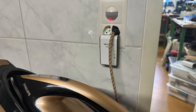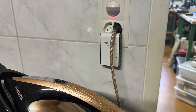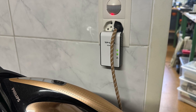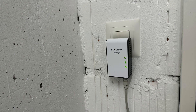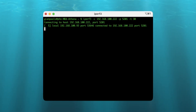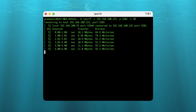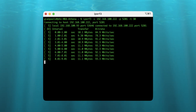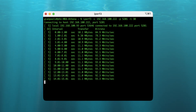To compare, here's another wall plug which I know is on the same circuit. My wife would certainly love to see that as a permanent installation here, besides her iron. But I'm only after seeing what bandwidth I can attain — and not surprisingly, I get back into a sync speed in the 400 megabits range. I even tried another one a bit farther, but still on the same circuit, syncing in at around 300 megabits. That's still enough to attain a constant 100 megabits when measured with iPerf. But given those wall plugs are nowhere close to the network rack, it doesn't solve my problem, as I would still need to have flying network cables.